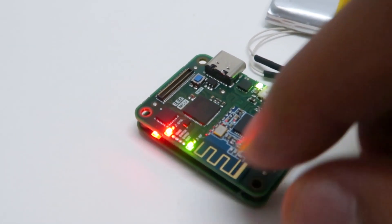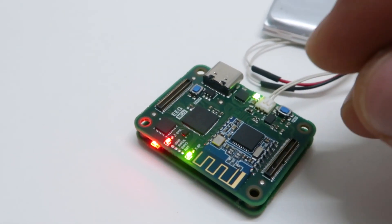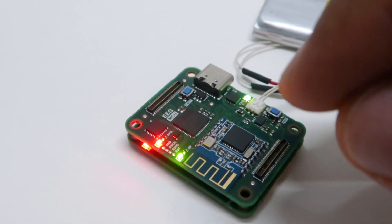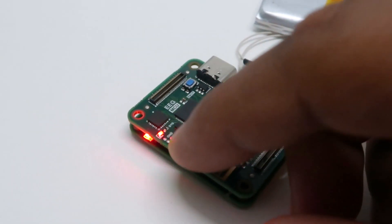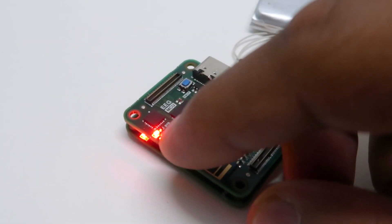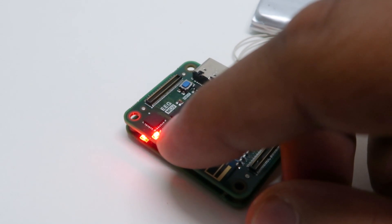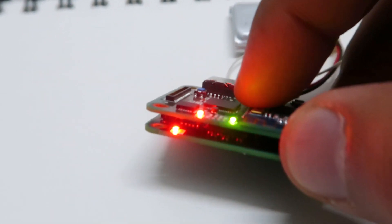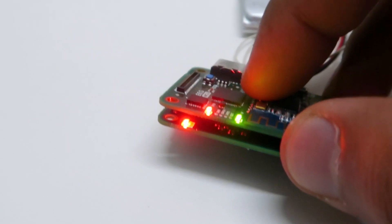By default the HM11 is set to be in a blinking mode. There are no followers controlling it at the moment except a very basic LED fade program on the RP2040, which is fading in and out the red LED. On the bottom board, the ADC stack also has a red LED to indicate proper power.